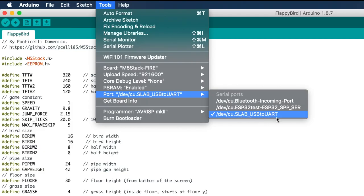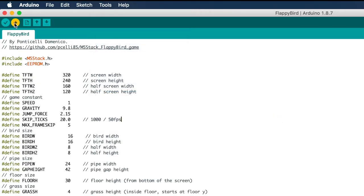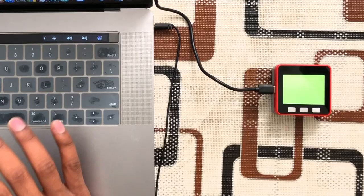Silicon Labs USB to UART. If this port is not shown, the particular port of this M5Stack, do one thing. You need to install the CP2102 drivers on your system. I will attach the link for the driver in the description of this video. So if the port is not shown, go ahead and install the driver. So I'll select this port and we'll click on this upload button and let's see if it gets uploaded or